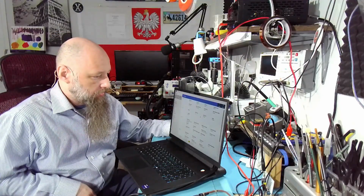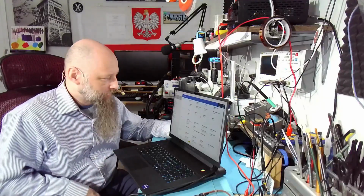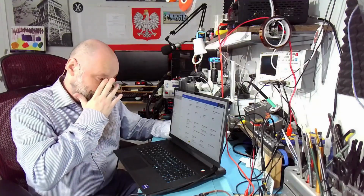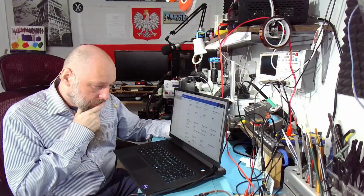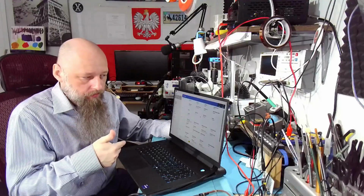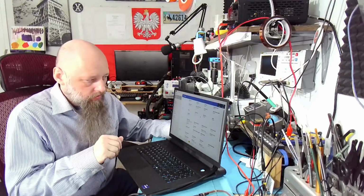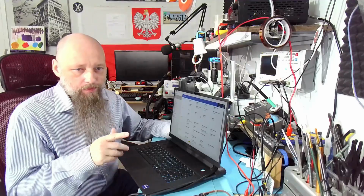It could be the GPU. I mean, it's in one chip, but still, I don't know. This is unexpected, because here's what I was going to do. Since we have charging issues but not powering issues, the computer is powered on properly, other than throttling. So my suspicion immediately goes to the SAM chip.